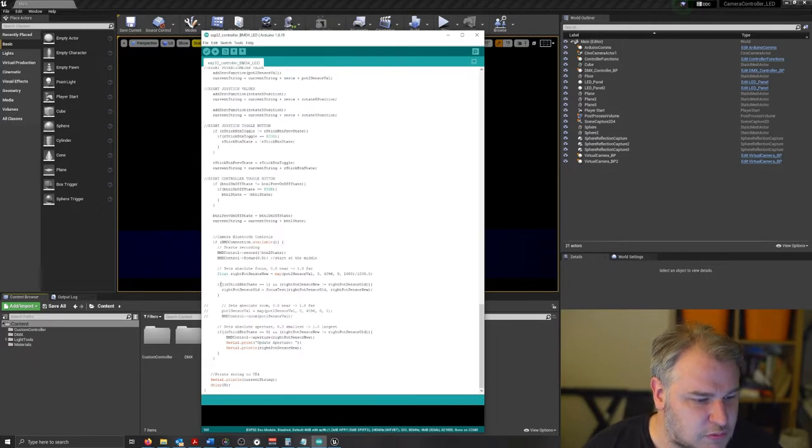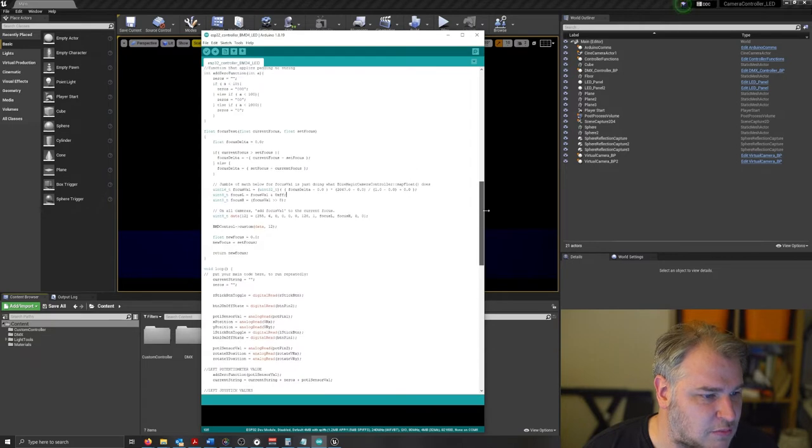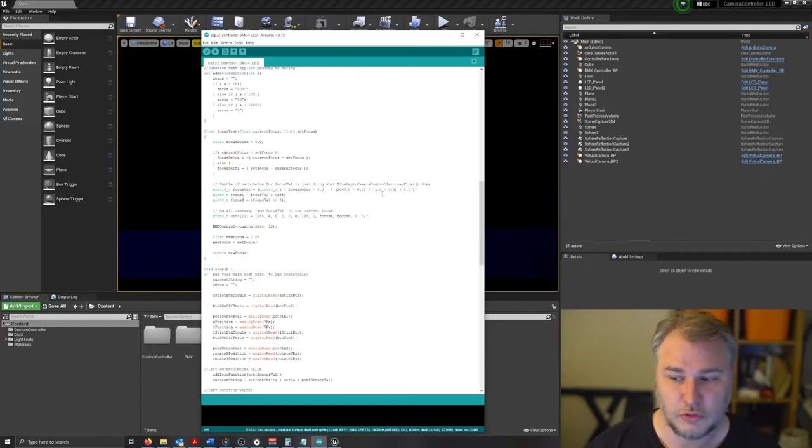So at this point, we check to see if there is a change between the old value and the new value, then we run it through the focus test function, which was the one up here. That runs some math, essentially converting it, doing what the SDK does but in manual code, pulled out into this. We convert it to a decimal or float value, and then we use that float value to adjust the focus length and height, L and H in here. And we basically just run it through the SDK.